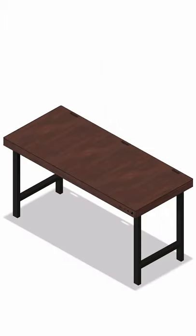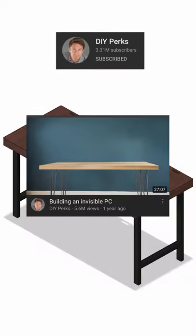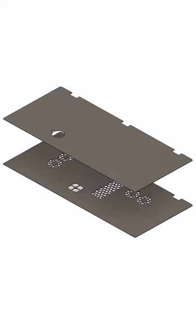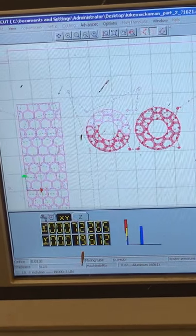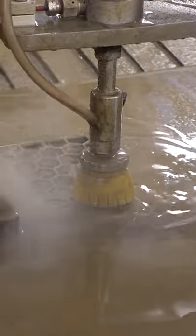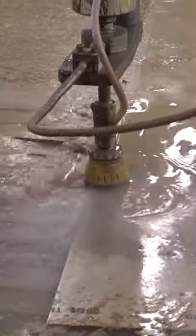Before we begin, I want to say this design was inspired by a YouTuber by the name of DIY Perks, and you can check out his desk PC build in the description. So the first thing we want to do for the whole build is cut the top and bottom aluminum plates. To do this, we were lucky enough to get access to a water jet CNC from my college. This machine uses an extremely high-pressured stream of water mixed with minerals to accurately cut through almost any material — our eighth-of-an-inch aluminum sheets, for example, were a piece of cake.